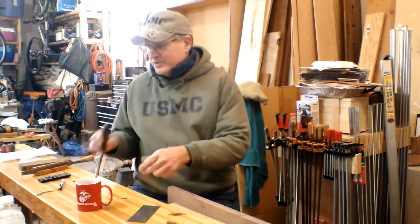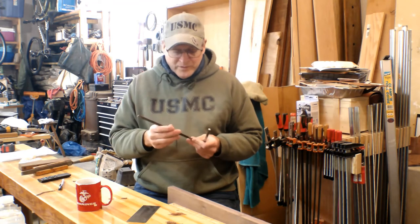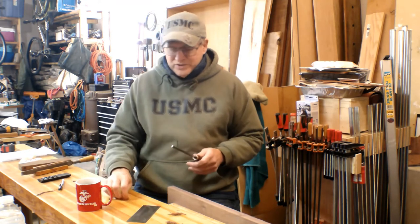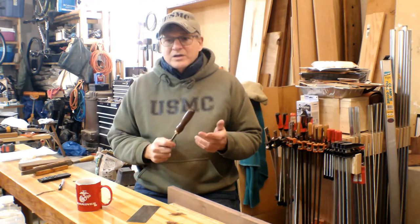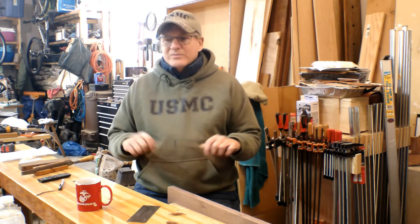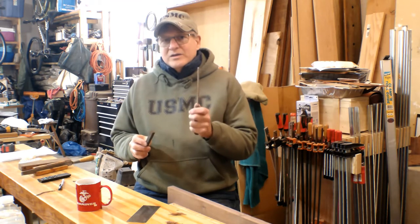You only need a couple of pieces. Really all you need is a fine mill file — this is a fine triangular mill file, it's a very fine-purpose mill file — and a burnisher. That's really all you need. A lot of guys do all kinds of different things; there are all kinds of tools on the market. I think Veritas or Lee Valley makes an all-in-one with an integrated burnisher and so on, and you can do all that kind of stuff. But all you really need are two things: a good fine mill file and a burnisher.